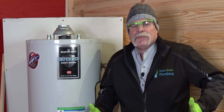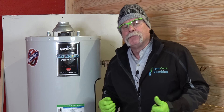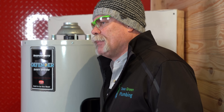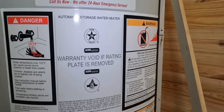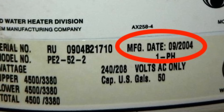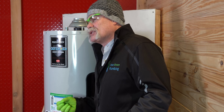If you've got a water heater that is say five or six years old, I probably wouldn't flush it at that point. If you have not started flushing it from the very beginning, you don't want to start now, because any microscopic cracks or anything like that may have got filled with anode rod deposits or plugged up with sediment. If you start flushing it now, it could possibly make that happen. Check when the water heater was installed — you can go to the label, check the serial number, check the model number, and do a little research. This one is a Bradford White. If it's over three or four years old, I probably wouldn't flush it, because that sediment may actually be what's keeping it from leaking.